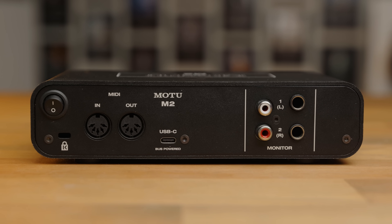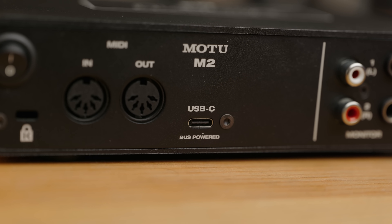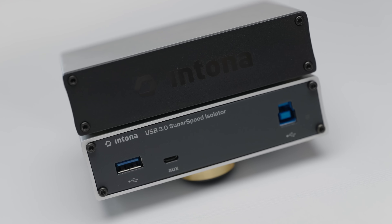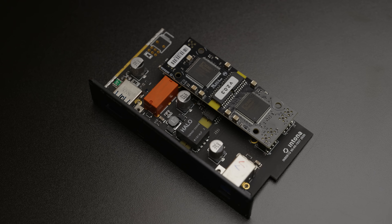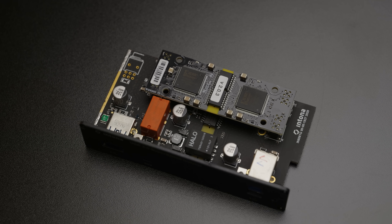One thing to mention is that this is actually a USB-powered device, so there's no external wall power, no IEC connection — it just runs entirely off the power delivered over a single USB-C connection. That does mean that depending on what device you're actually using to power this, it could potentially have an impact on performance. Because I wanted to make sure there were no bottlenecks, I actually ran this off an Intona 7055-D, which is an FPGA-based, extremely high-performance, low-noise isolator. It's really good, but it is quite expensive — actually about twice the cost of the Motu M2 itself.